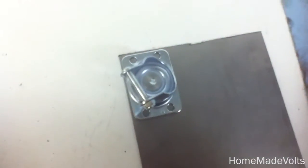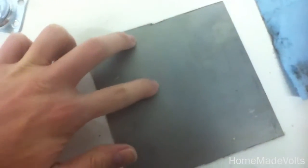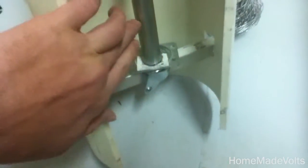I was not sure how to attach the pole of the auger to the base of my little swivel piece, so I kind of left the project alone for a couple days. You can see here what I'm talking about — how to attach those two. What I came up with is I will take a piece of sheet metal, cut out around this swivel, use a drill press to put holes in here and make a larger hole, probably for a 5/8 or maybe just a half inch screw, which will make a post that the pole will then sit inside. So that's what I'm going to do now.